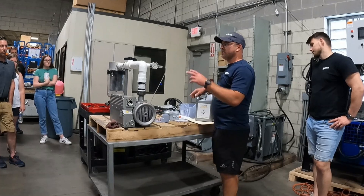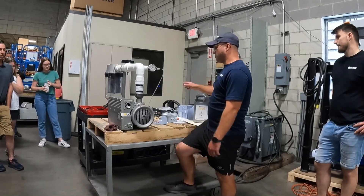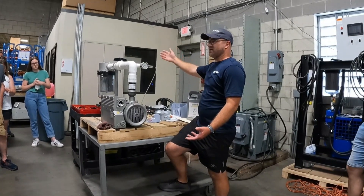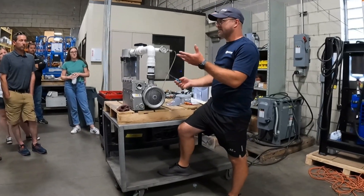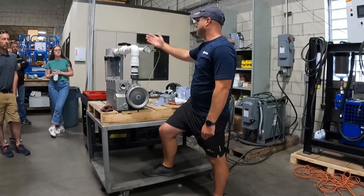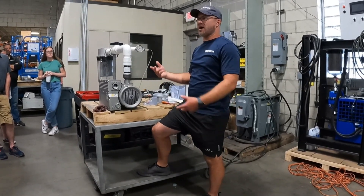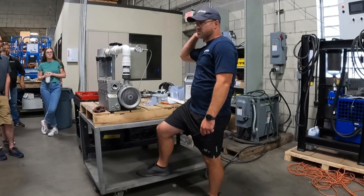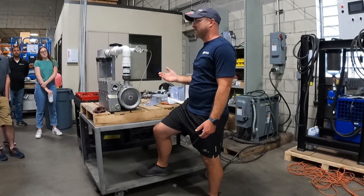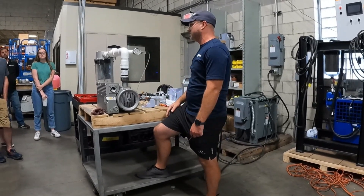You can go lower than 30 on the screen but it won't blow — it just stays there. Most of it's done here; we pre-wire and pre-land everything, so when you receive it you just wire your main power in and hook up your vacuum connection. That's really all you have to do. The internal anti-suck-back valve or check valve is in the pump, then the butterfly valve, and the rest is just normal plumbing. The filter is polyester — if it gets contaminated with water or sugar you can wash it, just make sure it's dry before you put it back in. It's not meant to be a moisture trap; it's more of a policing filter to stop slugs from coming in so they don't lock up the pump.